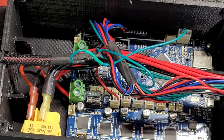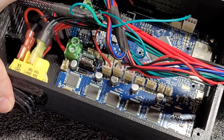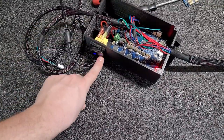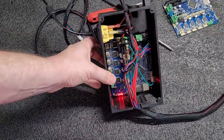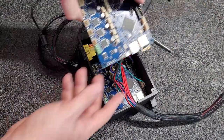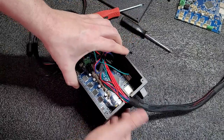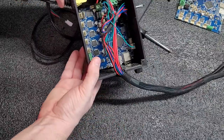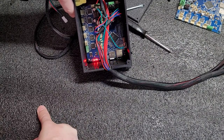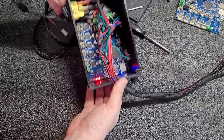You can then go ahead and test your board to make sure everything is working. When you turn your board on, you should have a light on the switch, and in the bottom right you should have three LEDs. One last step I almost forgot: you need to take your SD card from your old non-working board and insert it into your new one while it is powered off. When we turn on, these three lights should turn on, the LED should blink once or a couple of times depending on whether you are on S1 or S2 mode, and the Wi-Fi light should be solid on. And that is all you need to do to do a board swap with one of our 3D Potter printers.